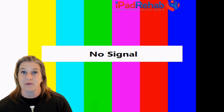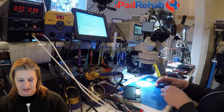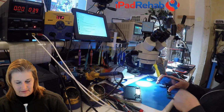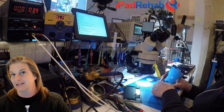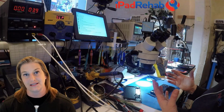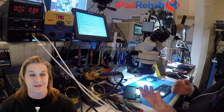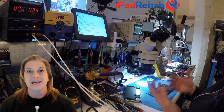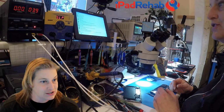All right, so that's an odd problem. That's why I wanted to do this one with you guys, because this is not a typical presentation. And you can see why my first thought was, let's change TriStar. Maybe this phone actually is booting and we just have an image problem, and the reason why iTunes can't detect it is because of a TriStar USB connection recognition problem. So that's why I changed TriStar, and it's in the same state as before. So what do you guys think we should do?